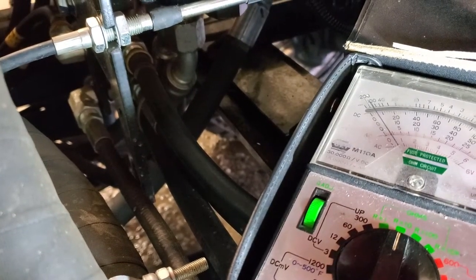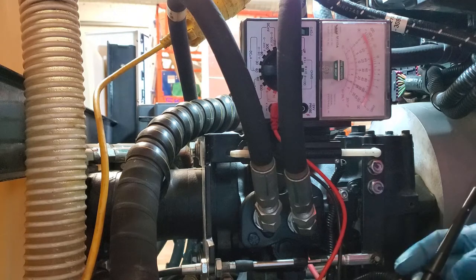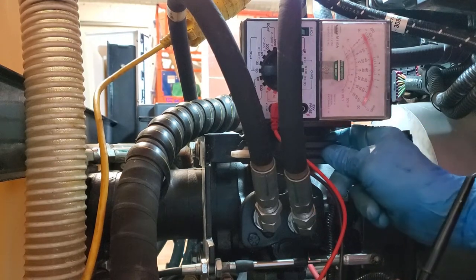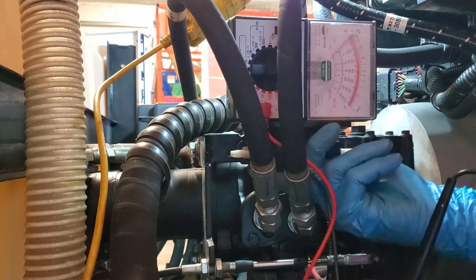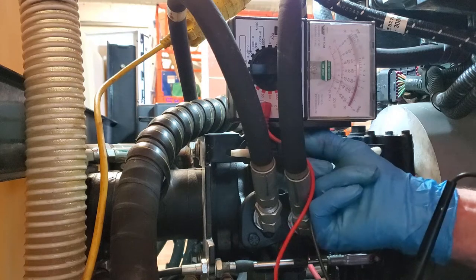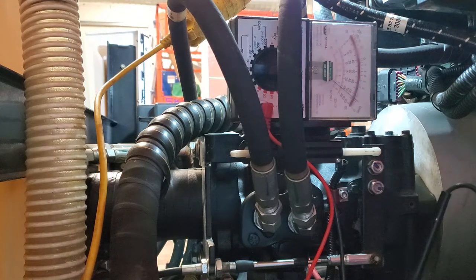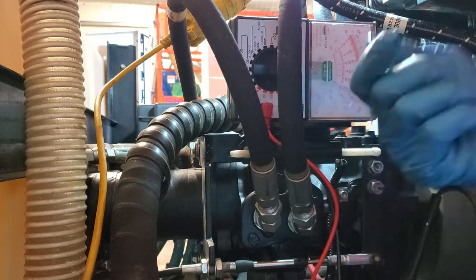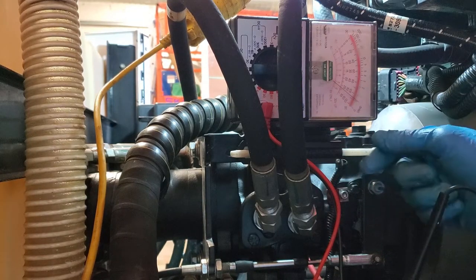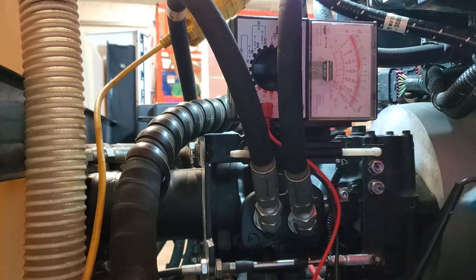Before I plug it in I'll make sure this thing's set right. I'll show you the voltmeter — it's in neutral, so we should have continuity. There we go. You can adjust this thing back and forth — not this, but the black thing — before we tighten it down. We've got to make sure it's showing continuity. I'm going to tighten that bolt down. I think it needs to go towards me just a little bit towards the front of the machine. This is how you test the switch to make sure it's working before you plug it in.